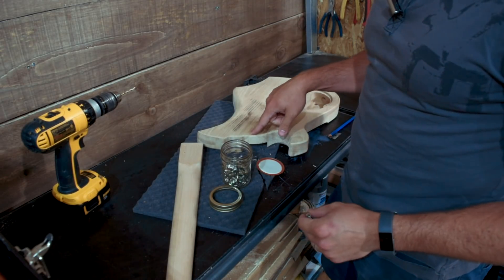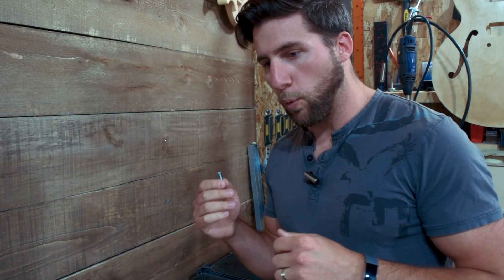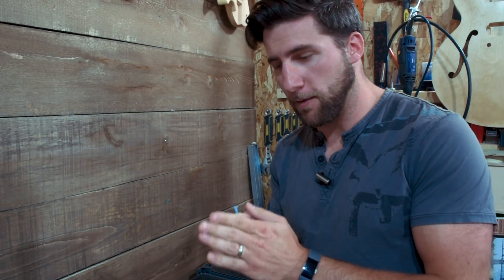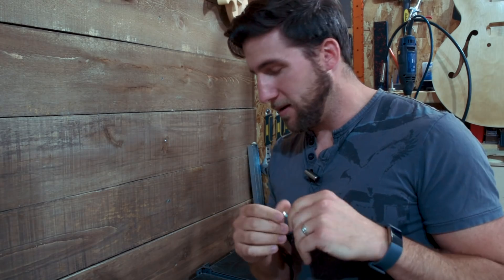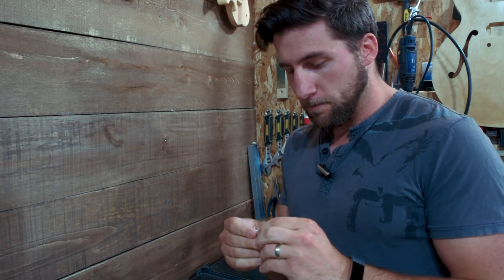Now it's time to drill these out. We've got a quarter-inch screw here and that obviously doesn't fit through our basically eighth-inch hole. The tendency is people want to drill these out at a quarter inch — they want the hole in the body to be the same width. My recommendation is don't do that. Do them a little bit wider. We want the tightest joint we can get between the body and the neck — it's just better that way. Some people think it affects sound transfer; for me it's more a case of just making sure everything is nice and solid. We drill that out a little bit wider so we don't have to worry about the bolt threading into the body and pushing it. The only contact we need is at the back where it's sucking in and against the neck where it's pulling. Drill the hole a little bit wider — problem solved.